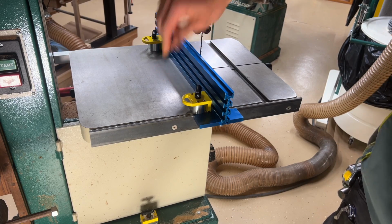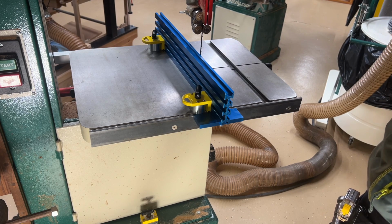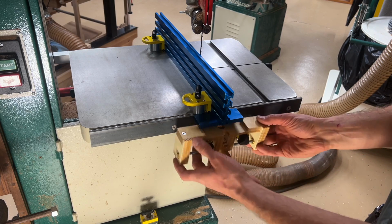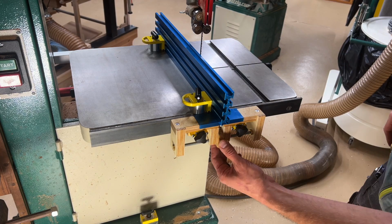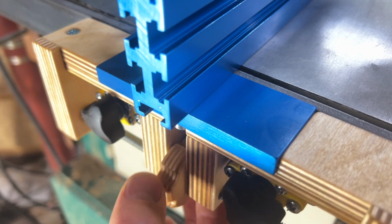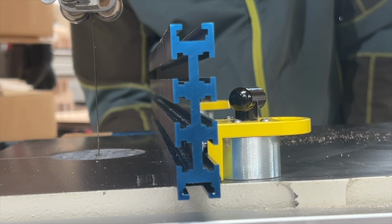Okay, skipping a few steps to final assembly, this is how it is supposed to work. Your fence is in place and you decide you need a fine adjustment. So you lock the micro adjust add-on into place with mag jigs on the front rail, turn off the fence magnets, and spin the wheel to move the fence. At first I thought it was working. See that adjustment happening? The problem is the back of the fence isn't moving.